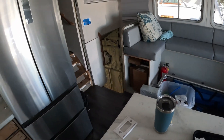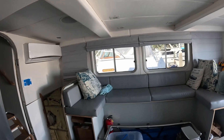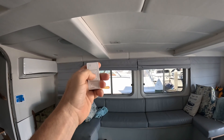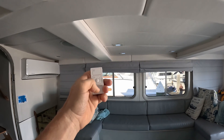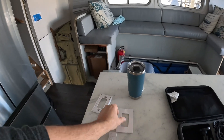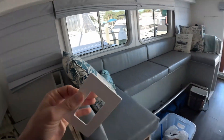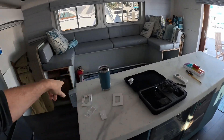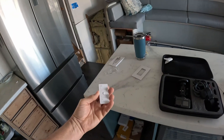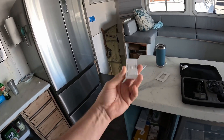So last night I got up here with one of these — that's the pro version. Got it installed, that went really quick. Then dealing with Home Assistant because you've got to write a little bit of programming. Once that was done, I can push it on and the lights come on, push it off and the lights go off. I haven't put in dimming capability or used the favorite button for scenes yet, but I have it on a slow fade going out. I'm really happy because now we can take this kit and put buttons pretty much wherever. I haven't checked range yet — like if I go all the way down in the engine room and push the button, is it going to make it through the steel? It doesn't use Wi-Fi; it uses something called Clear Connect, which I'm not sure if that's a Lutron standard or an industry standard.